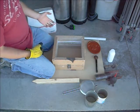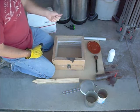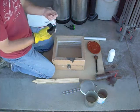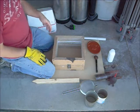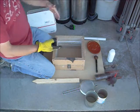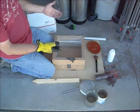I've heard some people do it by hand, but it's a lot of extra work, because you literally are crushing the oils back into the sand and knocking loose all the burnt parts, the carbon buildup or whatever it is, off of the sand. So that's a process, and a lot of people build machines. They put it in the machine, let it go round and round and crush it back in and turn it back in, because one piece turns it back into the center and another piece crushes it and blends it back in.